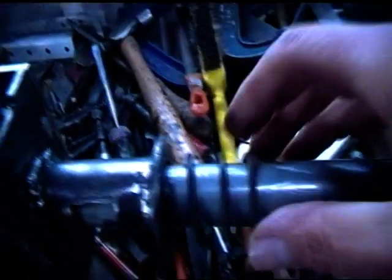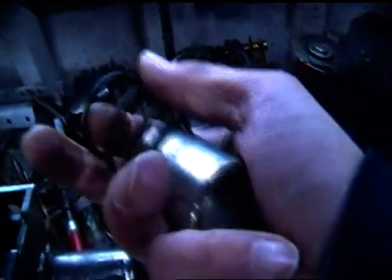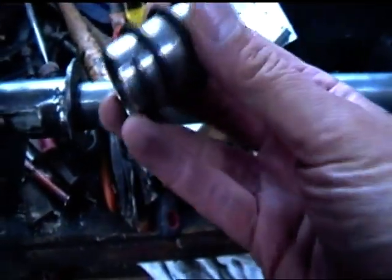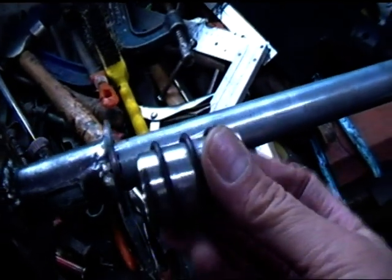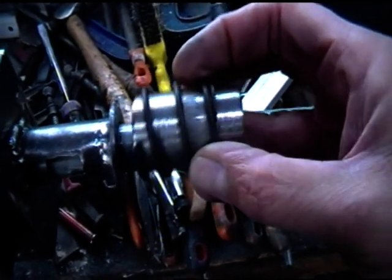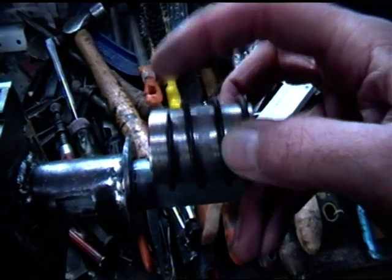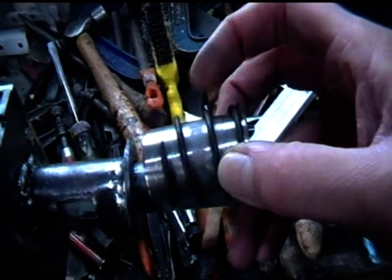Right, so basically what I'm going to be doing is fitting this spring, but underneath the spring, to make it a neater job, I'm going to be mounting the spring on this piece of stainless steel piping. You see, it just fits over it, and basically the idea is I'm going to cut through the middle of this stainless steel pipe, and I may weld the two ends of this spring to the pipe